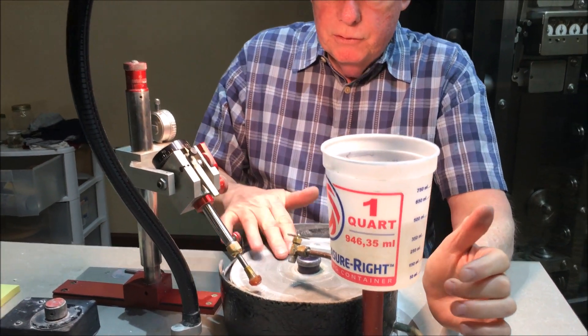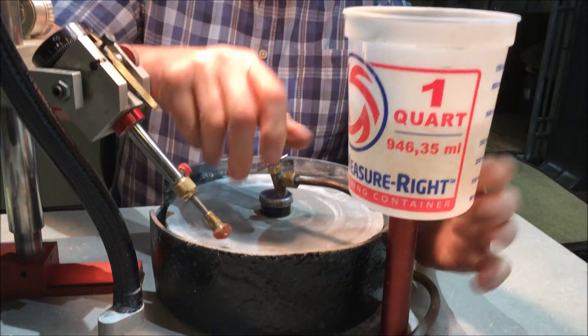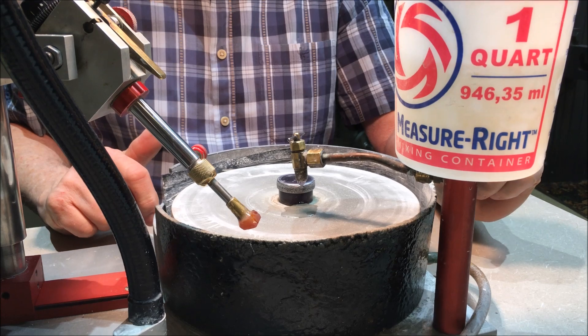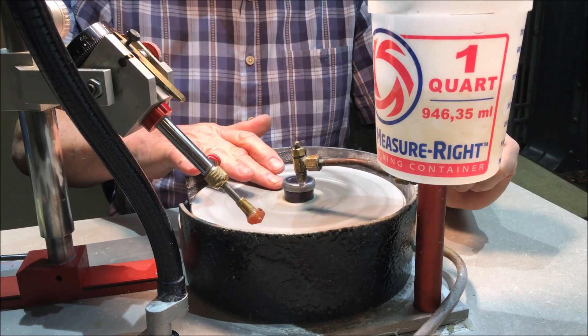This is the water. It's going to clear the swarf off your cutting lap as you cut — it's going to build up. When you're cutting on a coarse lap you'll need more water; on a fine lap you need less water. So that's going to clean the material off your lap.